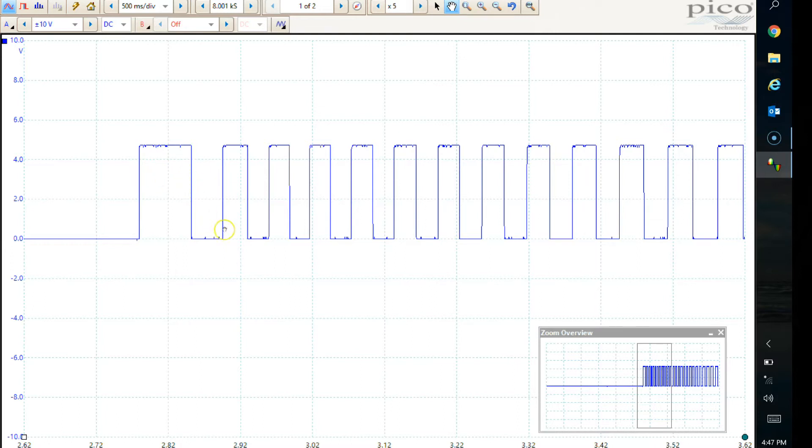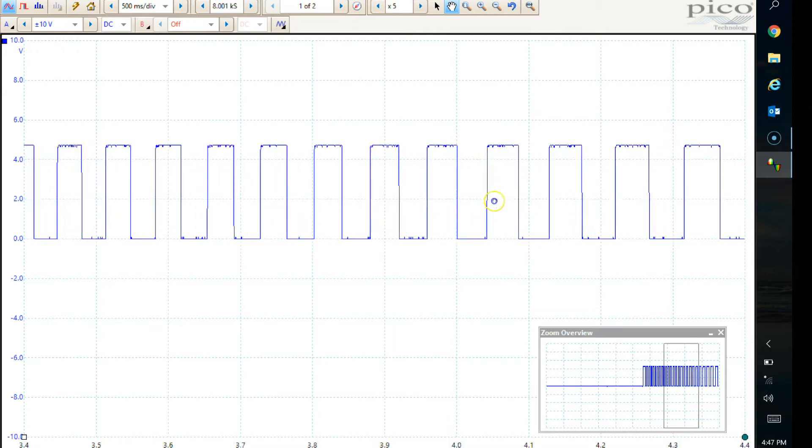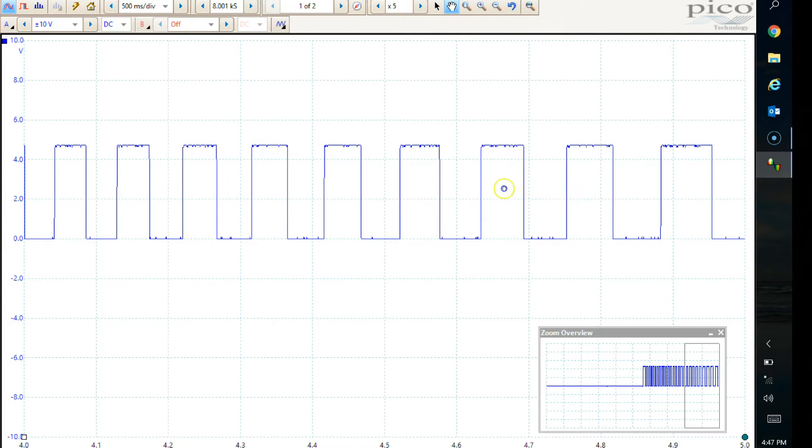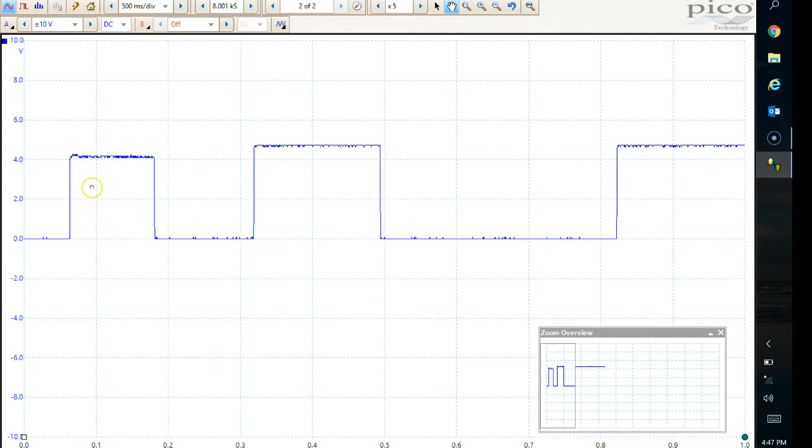The signal is electromagnetically induced. You can see the wheel is actually speeding up — the wider this block is, the slower the wheel is rotating. By about here I let go of the wheel, and you can see these pulses are all pretty consistent. As I slowly scroll across you'll see they start to get wider and wider because the wheel is now slowing down. On screen two it's already zoomed in — there are some varying voltages, probably because the rotational speed is very slow. We've got about 4.2 volts.